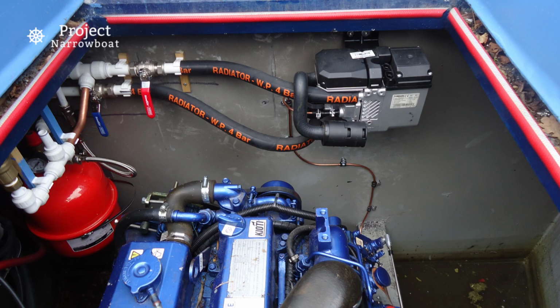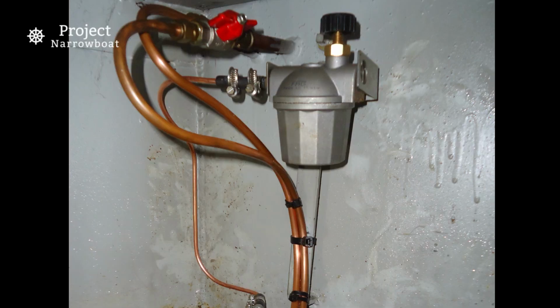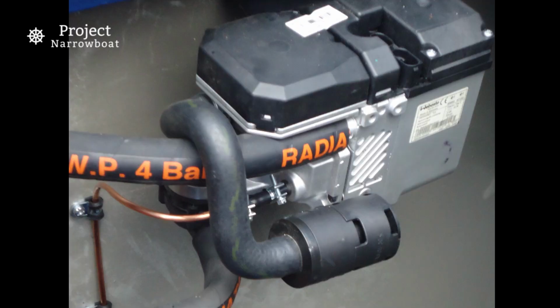Now after that we've got central heating, and that was surprisingly complicated in terms of all the little bits and pieces I needed to rig that Webasto up. So I bought all the rads, hung all the rads on the walls, that was nice and easy, and I got all the pipe and the usual bits and pieces. I say the usual, I normally work in copper when I do any plumbing, and I usually like to solder that, but obviously on a boat you don't do that, so you use speed fit, which is the common one to use, just plastic pipes that you can just tighten up. And so I bought all that and all the other little bits and pieces, adapter things to connect hose sizes from the Webasto to something, special fuel pipe. The Webasto likes a special kind of gauge of fuel pipe and a special kind of filter and special kind of mounting brackets for it. Everything you could possibly imagine for normal central heating, and then a few bits besides basically,